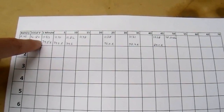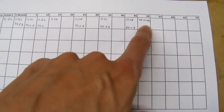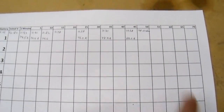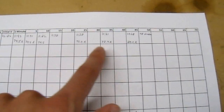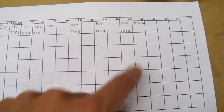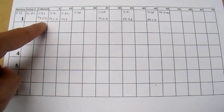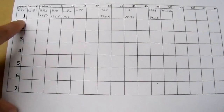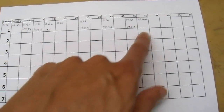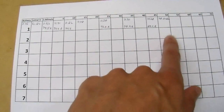I may not gather every data point since I don't want to babysit these the whole time. I'm using an inverter to do the discharge curve, and once it gets down to 10.5 volts, it will shut down. Battery number one lasted 48 minutes before the inverter shut down — 48 minutes at about 80 amps discharge. That isn't exactly 100 amp hours, but it's a very high discharge current, and this battery performed admirably. After recharging, it held its charge at 13.2 volts, so battery number one is verified good.